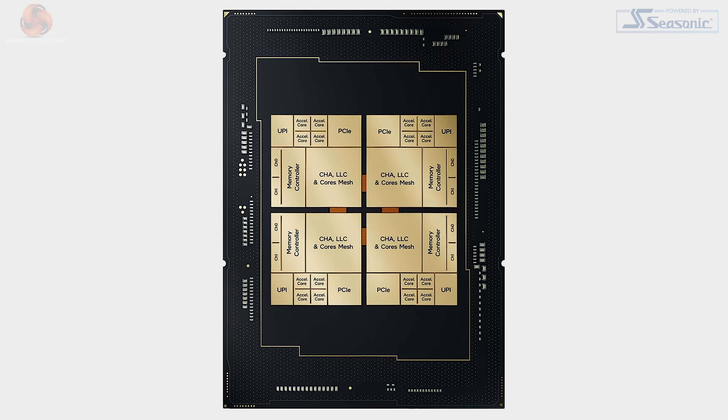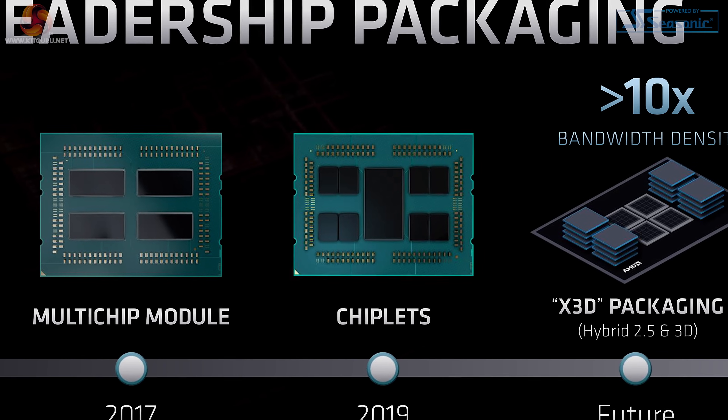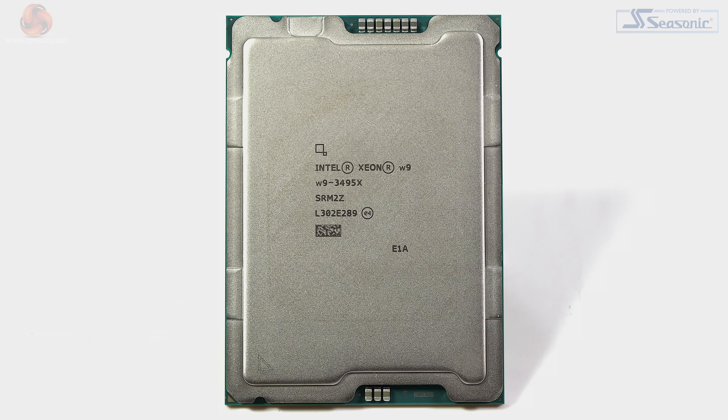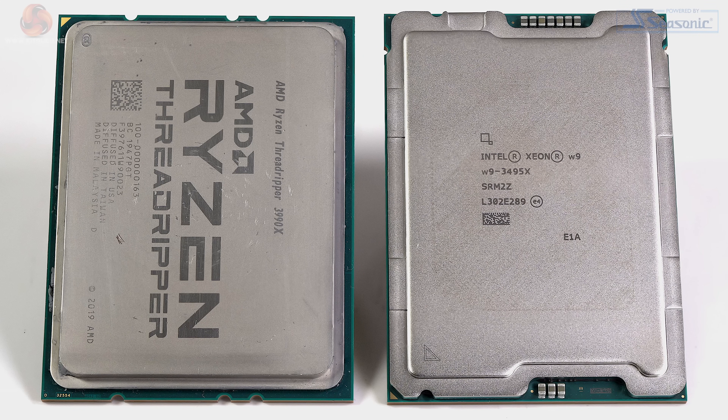Looking at a familiar diagram, we see the processor consists essentially of four different CPUs all tied together using an interconnect called EMIB. This is unlike AMD's approach, where they have a central IO die and a whole bunch of chiplets around the periphery connected together with Infinity Fabric. The upshot is that the new Xeons look large. Indeed, if you compare them to a desktop processor such as a Core i7-13700K, they look absolutely enormous. But just to put things in perspective, a Xeon sat alongside a current AMD Threadripper shows they are essentially identical in size.